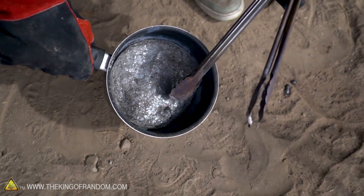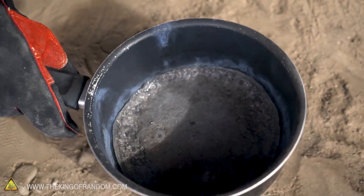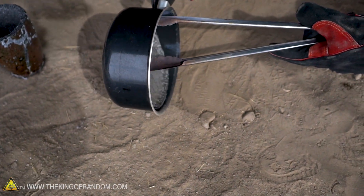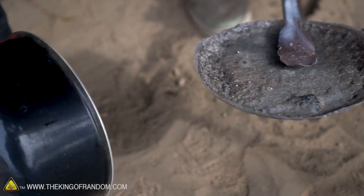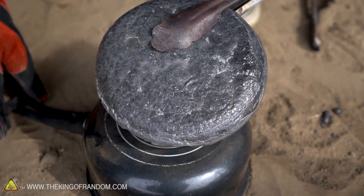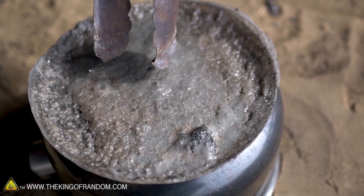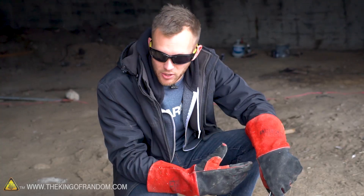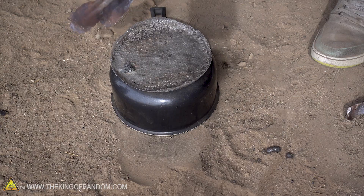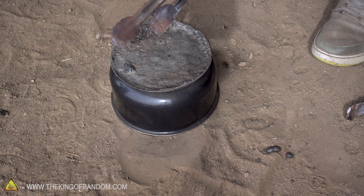We also have this one high point — that's right where I poured it. I think because it was landing right there first, it sort of built up in one little spot. This is pretty loose. Let's see if we can tip the whole thing out. Seems to have come off our pot completely — somewhat smooth on the bottom, pretty rough on the top. And we can see that it no longer has the white color that the salt did when we were pouring it out of its container originally. I'm pretty sure that what is happening is our salt is actually picking up a little bit of the trace chemicals and elements inside our crucible. Our crucible is made of graphite, so it could be pulling carbon right out of the graphite, and that might be what's giving us this gray color. It also might have something to do with the cooling temperature and the situation in which it forms back into a crystal.